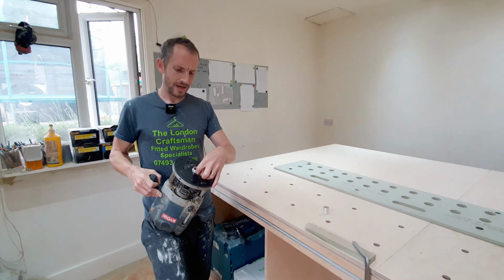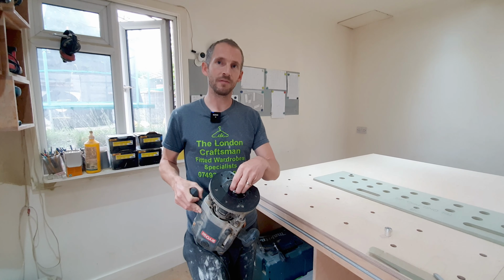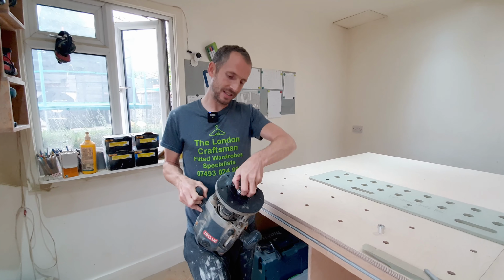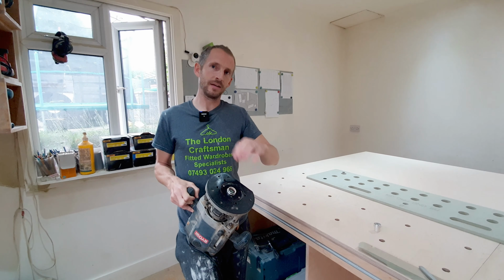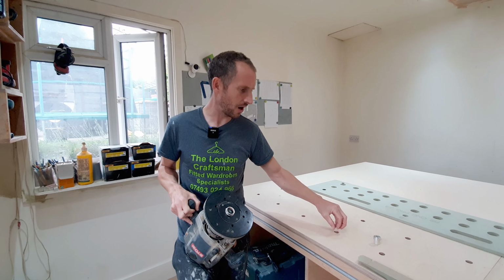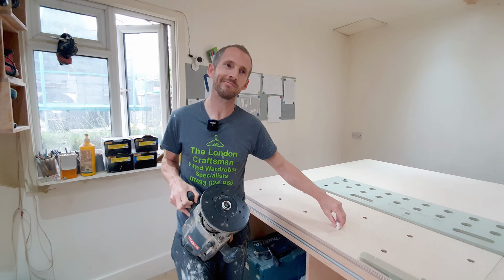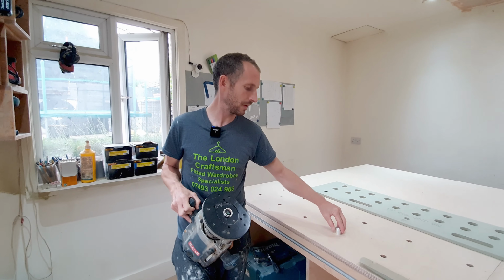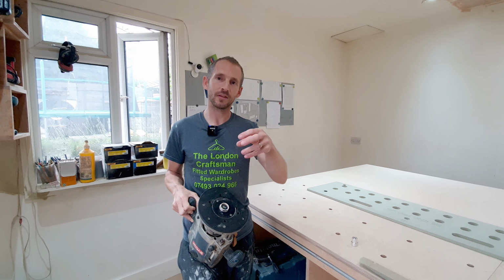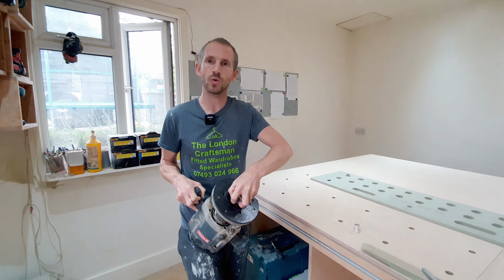I worked out that I need four layers of the aluminium tape that they supply you with. Basically wrap it around nice and tight, stick it on, another layer, another layer, another layer, until you've got four layers. I found that gives you exactly the right hole. Without that, there was just too much slop, probably about three quarters of a mil to a mil. So before you start, do a test run: do one layer, then two, then three, then four, and work out what works for you. But remember, once you've used it once or twice, it might get squashed down a bit.